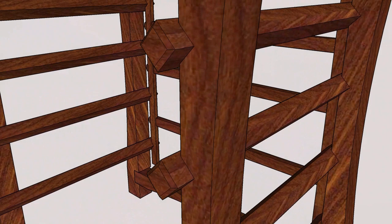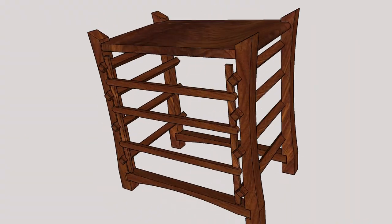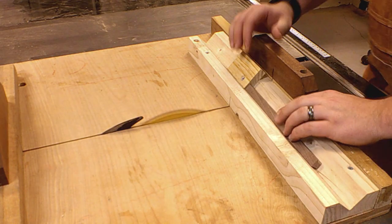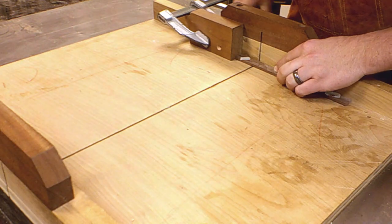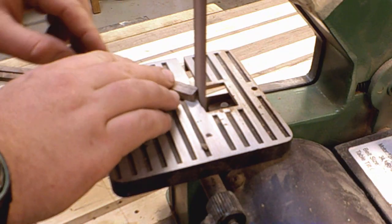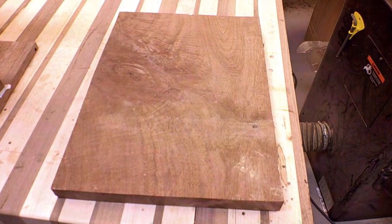With the legs completed, I move on to the diamond drawer guides. These guides have a slight chamfer at the ends. I have my router table set up with a chamfer bit and I am using a backer piece to avoid any tear out. Now I can begin working on the back joinery, starting with the 45 degree notch in the diamond guide that holds the vertical support — back to the V-block to cut those out. Now I will cut the dados in the vertical supports, back to the crosscut sled again. Finally, I use the belt sander again to round over the ends of the horizontal supports.